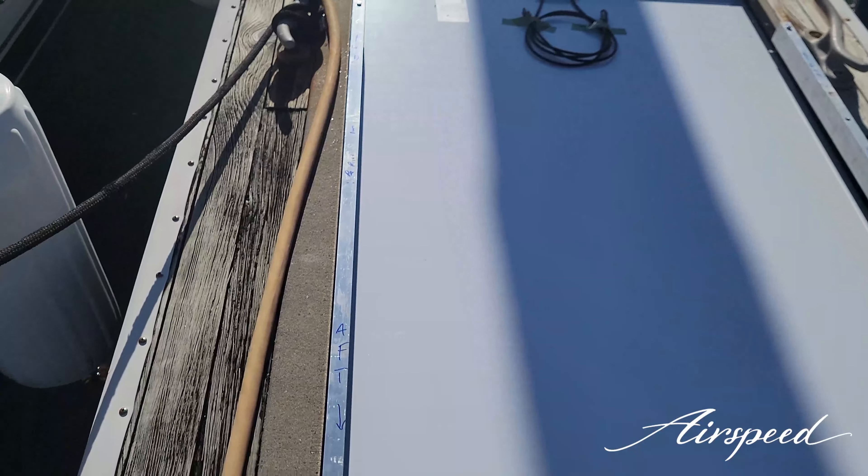What I've done is marked here the center line, and I've taken a piece of pipe — you can see this line going this way — on the other side up here, and I've scribed a tangent line; it's essentially a single point. Then on the top side I've scribed a similar tangent line so that we have opposing holes and a straight shot. Because once again, you just can't hold the drill perfectly straight — I wish I could.